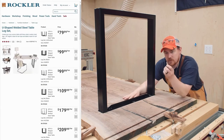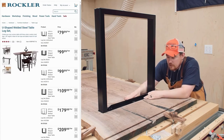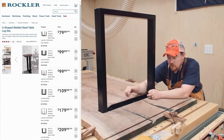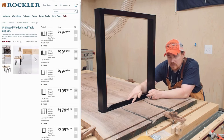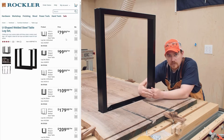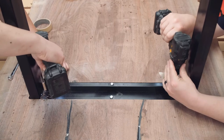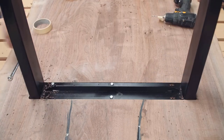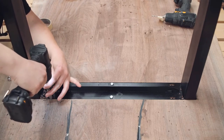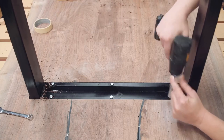These are going to be attached with some lag screws. It's important to note that when you attach a set of legs like this, the center has just two holes that are drilled - so it's going to pin the center in place. Wood will always move, metal won't, so you need something to allow for expansion and contraction. In these table leg pieces there are slots on either end - holes in the center to pin it, slots on either end to attach it and still allow expansion and contraction.